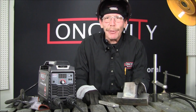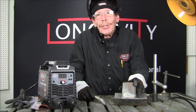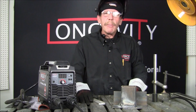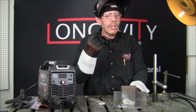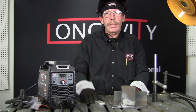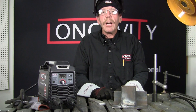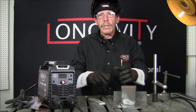So it didn't turn out too bad, really. I don't profess to be an arc welder — just a welder. If I can see it, I can weld it pretty much. It'll turn out pretty nice; it's a nice and easy flow. You've got to remember, though — keep your rods dry, because any kind of moisture gets sucked right into that flux and you'll have trouble striking the arc. If you do have trouble striking the arc, turn up your amperage a little bit — it'll burn a lot better. It does come down to the condition of your rods.